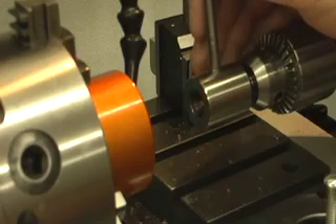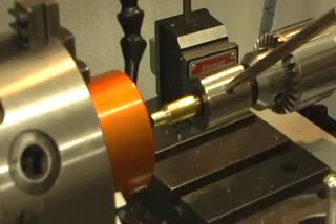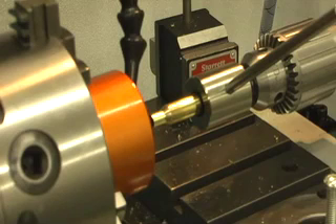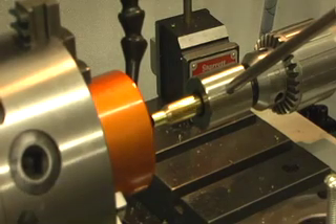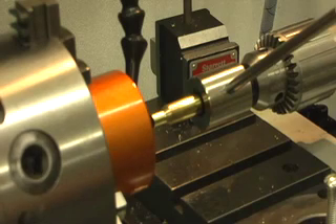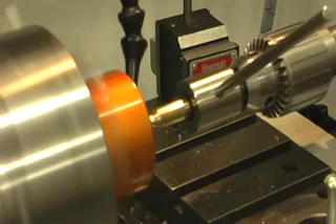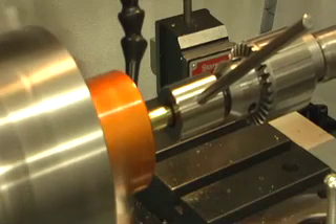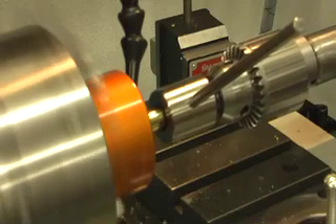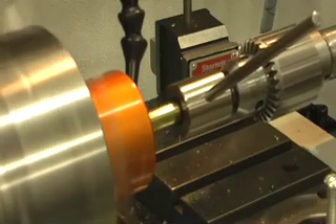Here in operation: to put a case in, you simply insert it and lock it up like this. With the lathe on, we first turn the coolant on, which is a mister coolant, which really does a great job because it's applying cool air and coolant at the same time to the same pipe. Now the lathe is on, and you will see how easy it is to just feed this case right onto the mandrel — like that.